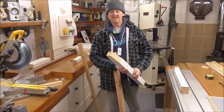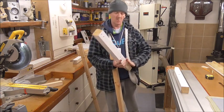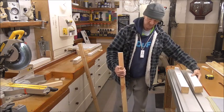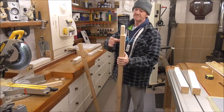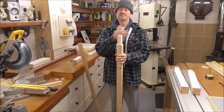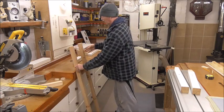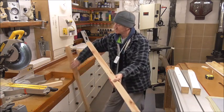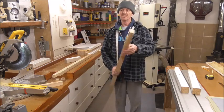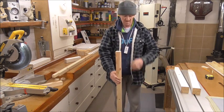And this one I've chamfered from 2 sides because it's going to sit in the middle with that against the wall. So I want it evenly down, both equally. On the bottoms, this one is going in the corner. That's to allow for skirting board. I want it to butt to the floor, so all the weight is transferred straight to the floor, should it decide to move at all. And this one, I've just notched the 1, so that will then sit against the skirting board that way, and it will be fastened to the wall.